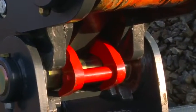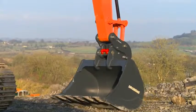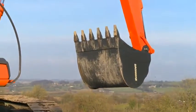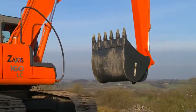The coupler is now ready to pick up the attachment. Engage the front jaw of the coupler with the front pin of the bucket. As the attachment pin engages with the front jaw of the coupler, the front instantly locks, eliminating pick and place of attachments.